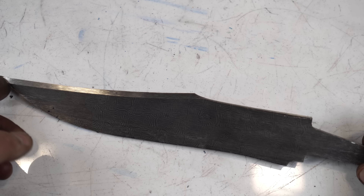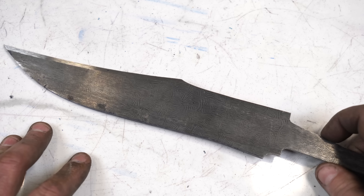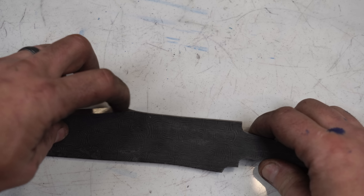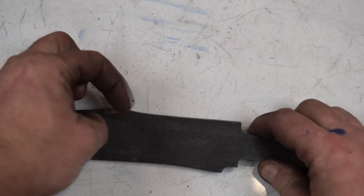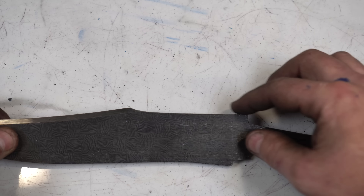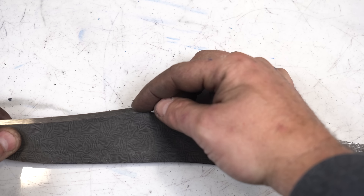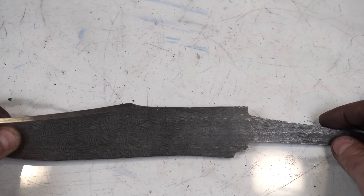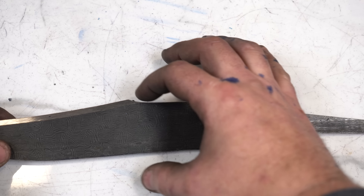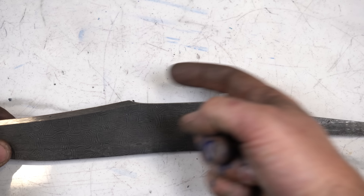One last thing: you'll notice I'm doing this before I do the bevels. When you do your grinding, you'll wear off that little tip and it won't be as sharp — that's fine. Just go back on your platen and push it about a sixteenth of an inch and it will take that flat spot off. If you've got a really small knife, put the false edge a little further back than you want because you'll just push it that way anyway.